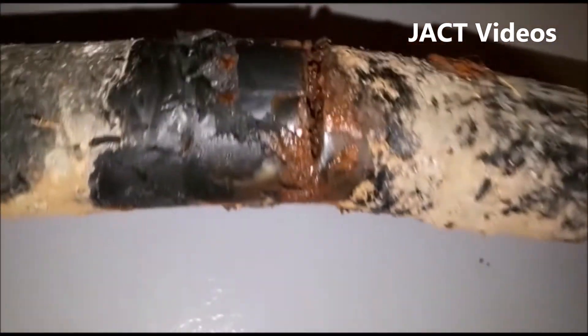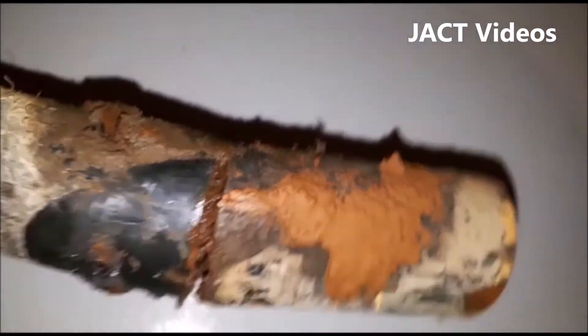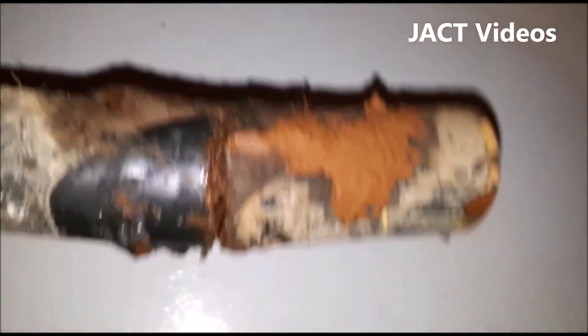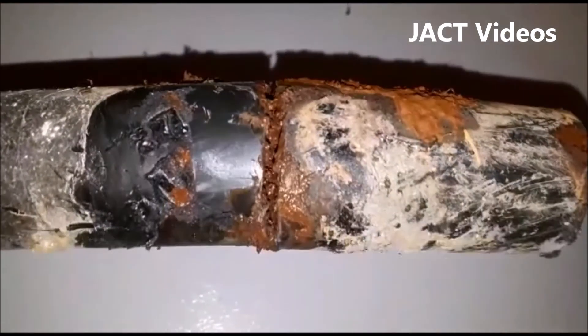As you can see, the break is on the top of the pipe and the bend is at the bottom. This is for sure caused by pressure of the dirt from the top and the ground shifting in the winter due to extreme cold weather conditions. This quite often happens to pipes going outside from inside the house, especially in newer built homes when the dirt settles over time — it causes shifting and pressure on the pipes which may cause them to break.